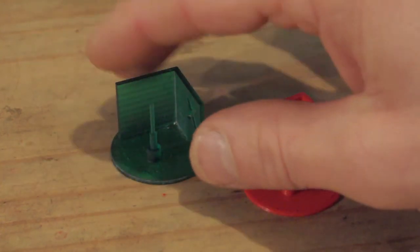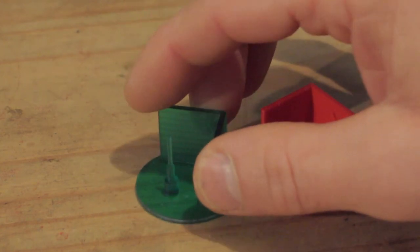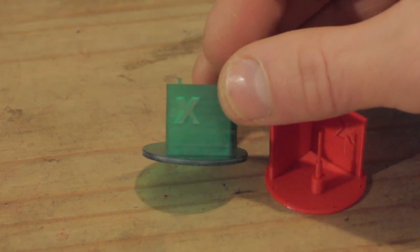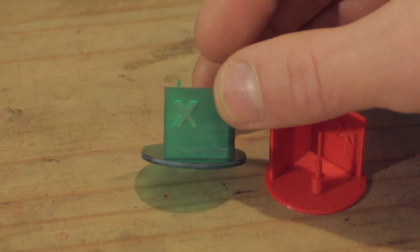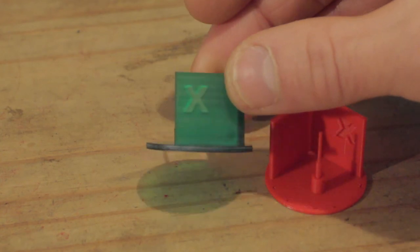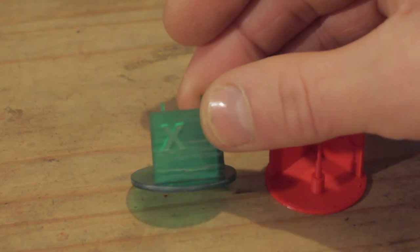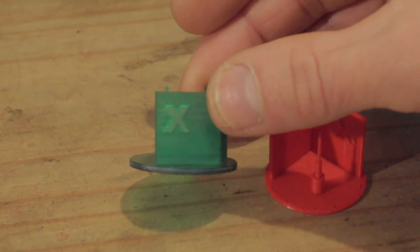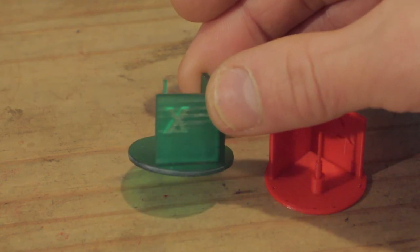Now, obviously, the resin print is incredible quality, as you would expect it to be. And if you look at this here, I do have some sort of lines going on there, so I'm going to ask on the forum, but I think I might actually have a slightly wobbly gantry on the lead screw, which I need to tighten up, and this is not an uncommon issue, and this is what this particular Not a Cube file is designed to test. So I thought this would make the perfect first print for that reason.